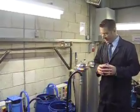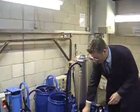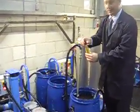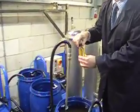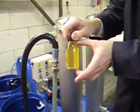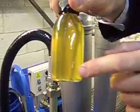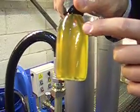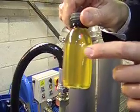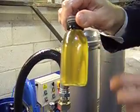As well as the magnesium silicate. We'll start off by taking a small sample of unwashed biodiesel, and as you can see at this point, it's still highly contaminated. We're purposely doing this on a very small scale so that you can really get to understand exactly what we're doing here and that everything's completely transparent. Very milky and cloudy at this point, containing magnesium silicate as well as production residues, methanol, caustic, a bit of moisture, possibly some free fatty acids, and probably small amounts of glycerol.